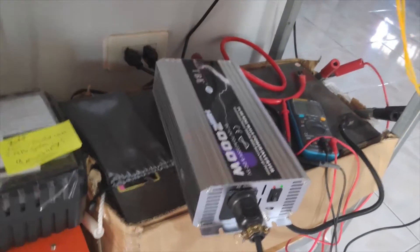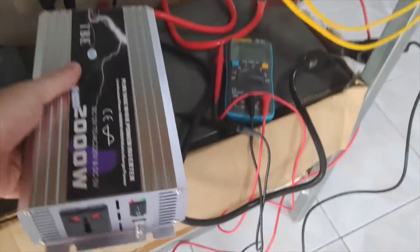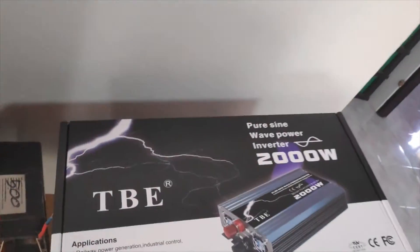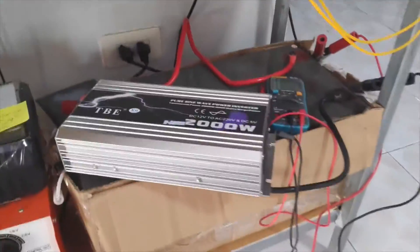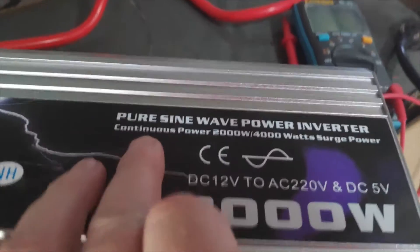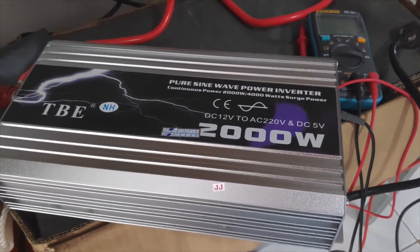The rattle has come back again — I'm not sure what that is. Maybe I can mount it somewhere to reduce it. Anyway, I bought it today, just unboxed it. I received it about an hour ago and just wanted to plug a few things in and see if it does what it claims — 2000 watts continuous power, 4000 watts surge. Well, that claim seems a bit dubious because it wouldn't power my circular saw which is only 900 watts.